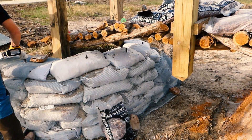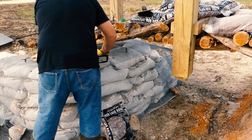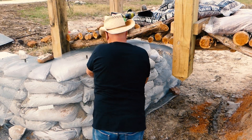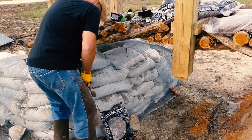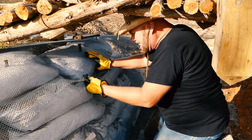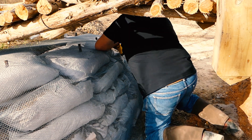As I wrap them around I put them through the rebar. I've got rebar going all the way through these bags and into the ground. But these need a lot more love than that - the rebar was nice to at least get them staged in place. Then each one I have to form, and I'm using a small sledgehammer to form around all of the bends. I wanted some sharp shelves where I could mud stones into it, but I didn't quite pull off the sharp shelves. When you bend that stuff it still leaves a radius.